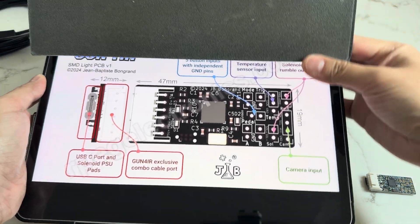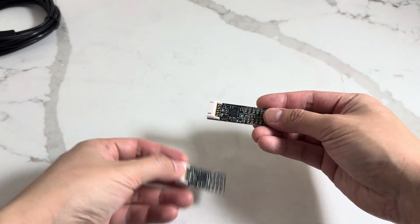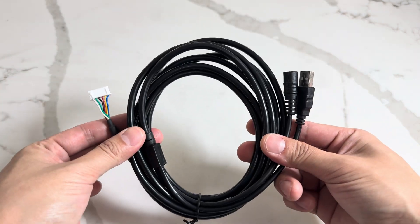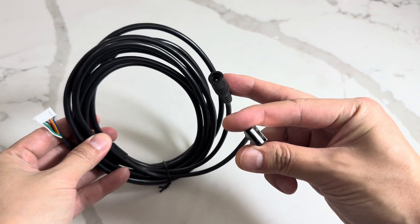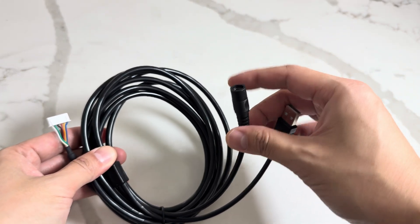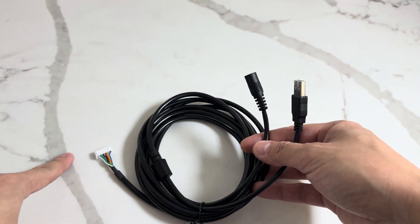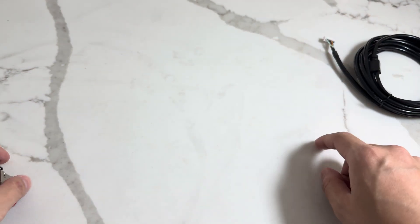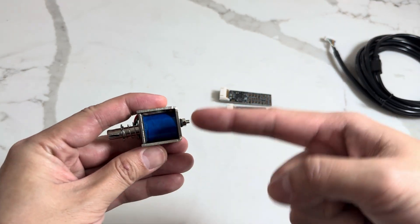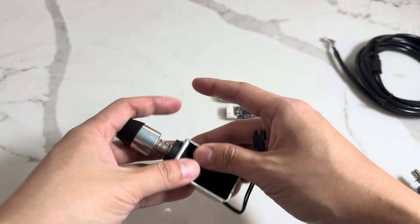You can buy just a PCB if you want to DIY everything yourself or use USB-C. But if you purchase the accessory kit, to make life easy, we include our exclusive 10-foot cable with USB on one end and a standard DC barrel connector on the other. You use whatever voltage power supply you want — you put in 12V, you get 12V out; you put in 24V, you get 24V out. We do not include a solenoid because these are universal — you might use a small 12V solenoid or a big chunky 24V solenoid, so that's up to you.